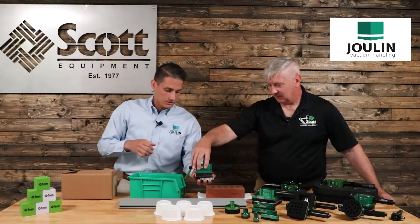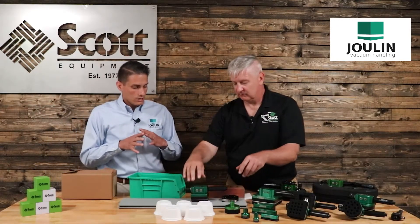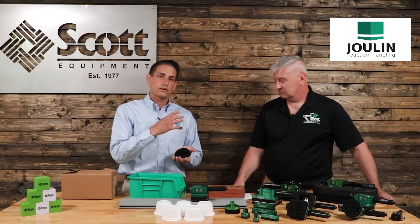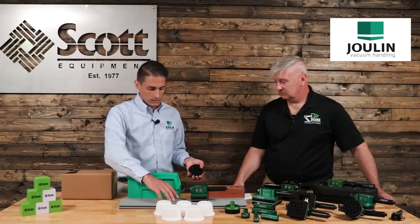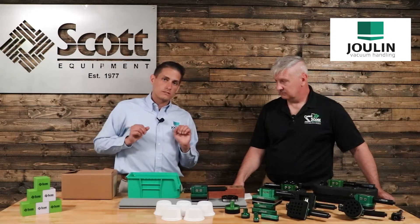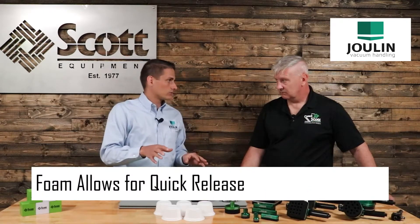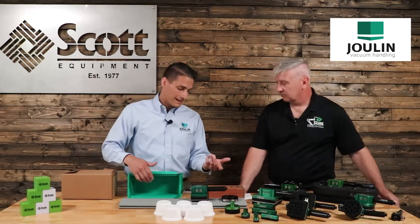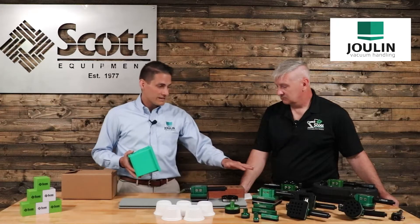If you'll hold this, I'll turn the vacuum off — there's a very quick release there as well. One of the great things is that the foam is able to comply to the layer and create a seal regardless of whether it's porous, rigid, has edges, divots, or anything like that. When the foam is not under vacuum pressure, it's constantly trying to push the product away, so you get a very quick release — almost like a blow-off effect. And we can actually add that functionality too. All of this is being used with the same gripper — this is still the same 80 millimeter check valve gripper.